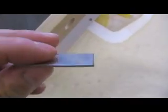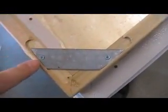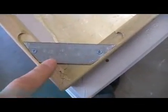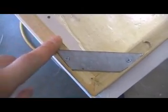The next step is to figure out how to attach the collar to the lid. I have some thin sheet metal scrap, and if I screw this to the collar and have it hang out like that, I can then screw through here into the lid. I basically made a gap so that this strapping — or cleat — screws down into the collar, and when I flip it back over to attach it to the lid it won't protrude and create a gap. You can see how the cleat sits flush onto the lid. I'll put a few screws through the cleats right into the lid, and when I put the plastic cover back on it'll sit right on top of these, so when I put the clips back in that'll also hold it down.